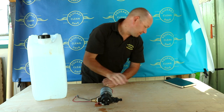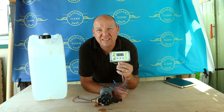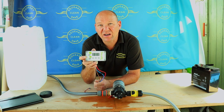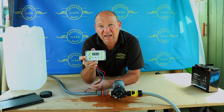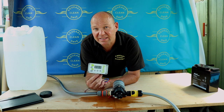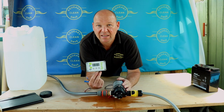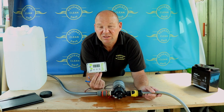Element number three: the controller. Here is the controller — this is the Spring basic controller, and it's probably one of the most important parts of the whole system. It allows you to set the flow rate of your water, so you can use a lot higher flow or a lot lower flow — more or less water. It also detects dead ends. A dead end is basically when it turns the pump on and off when you stop the flow of water, so if you disconnect your pole you don't want your pump to keep running against a shut-off hose and burn it out.